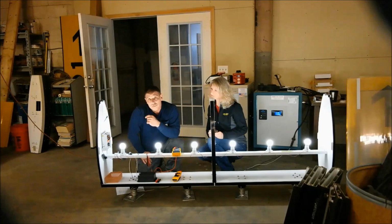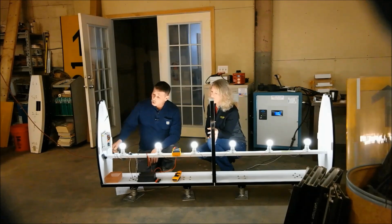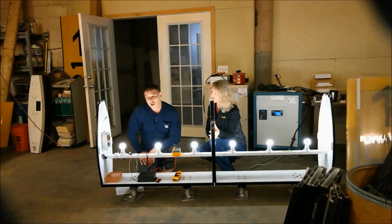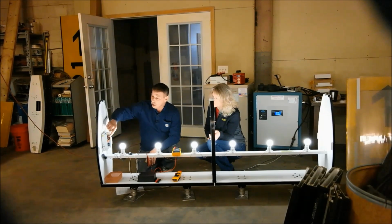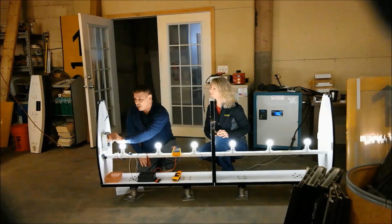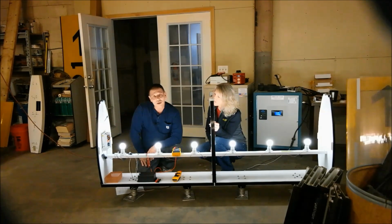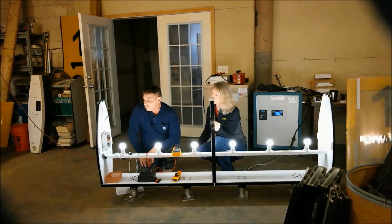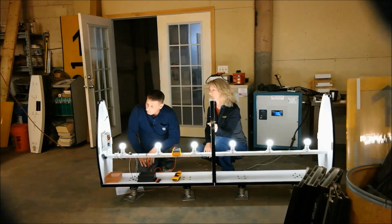So now I'm a little puzzled as to why I came out here to troubleshoot this sign and can't find anything wrong. So I'm going to look at the controller and see if I can find any signs of visual damage, any components, any kind of burn marks, just anything that's going to flag me. Capacitors that are puffed up, maybe shriveled up plastic on the outsides of them. But as I look at this controller, it basically looks perfect. I can't find anything that's wrong with it. No signs of corrosion? No corrosion. It seems like it is a perfect controller.